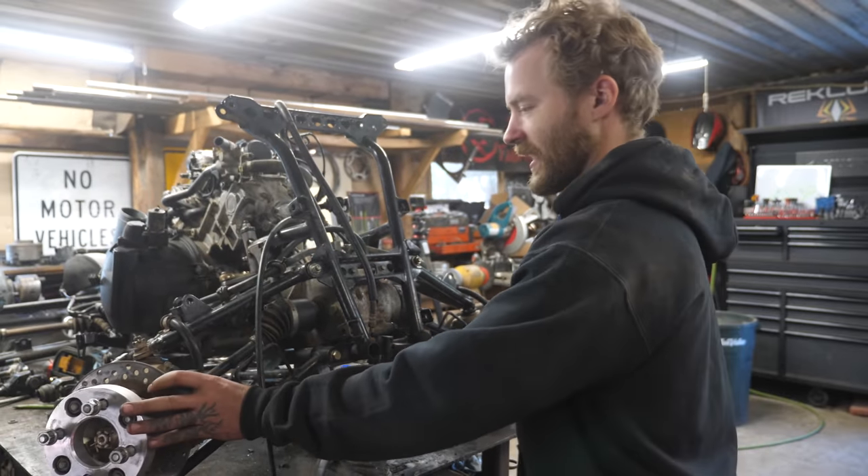I have my detachable frame chunk here that I'm working on. I tacked on just this front part here to test if I can get away with it this way — if I bring this junction back here then I can have the reinforcement piece here and that doesn't have to be removable, which is stronger, lighter, and simpler. This is a test to see if the engine can come out — should be able to sneak out diagonally. Yep, there we go — that's the goal and it works. Most importantly, the removable section is removable!